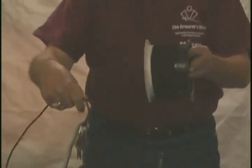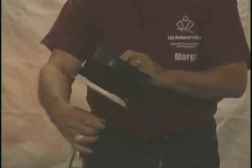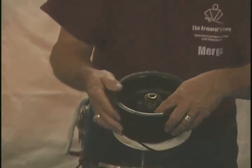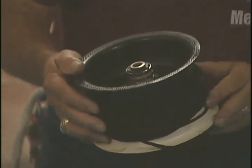When you're replacing it, if you just want to, you can now just take the cable completely off and then replace it. With this one, it's very easy to replace — you just feed the cable through the hole, you tie a knot in it. There is a protective coating on it, and then you just solder the particular wires to each of the connections.